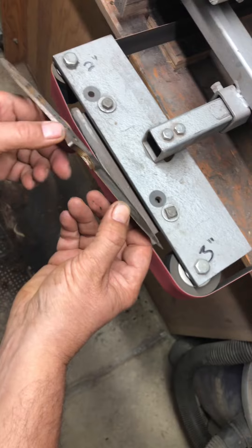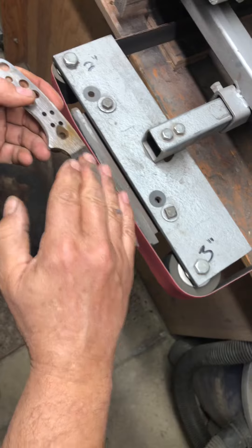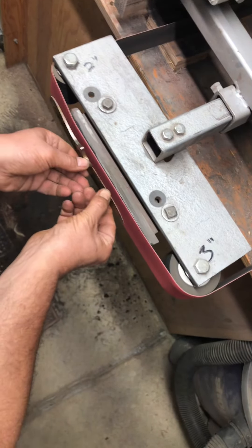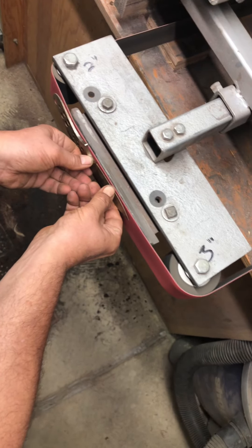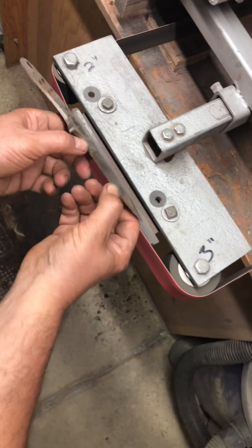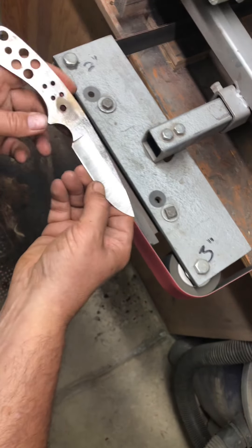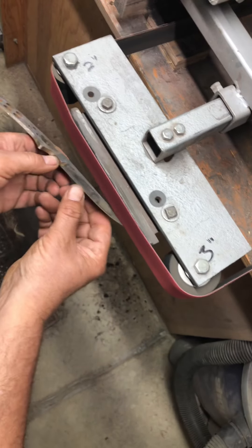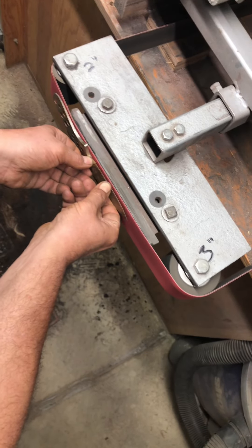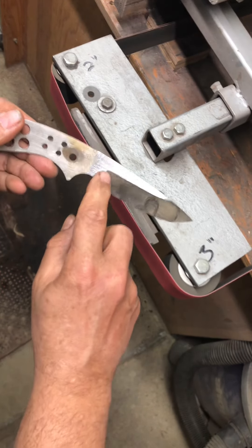This area is now ground away from the edge. You see where my flat spot is? That's where I want my thumb to be. If your finger is down here you're actually going to put too much pressure and create a curved shape on your flat — I want my flat to stay as flat as it is. Then I just put it up there, find it, equalizing, and you're going to put pressure this way and then pressure this way. As you can see, I started getting a pretty even sanding mark.